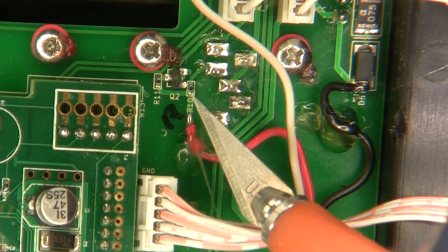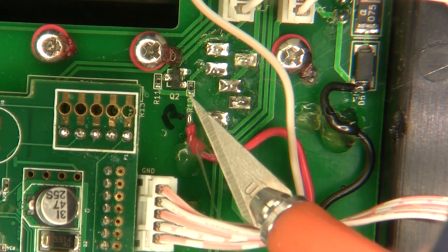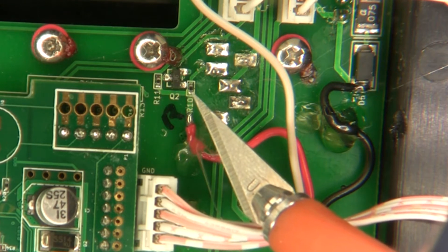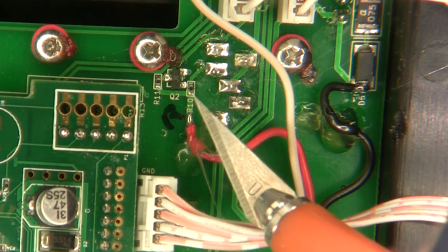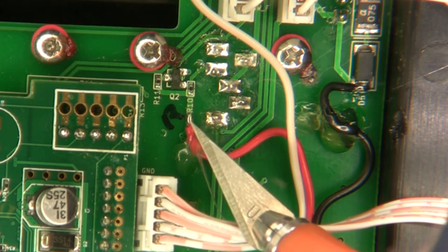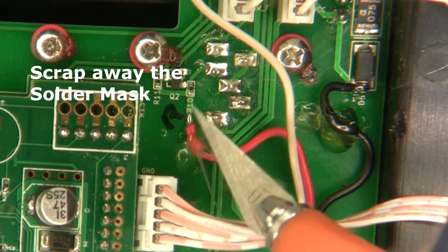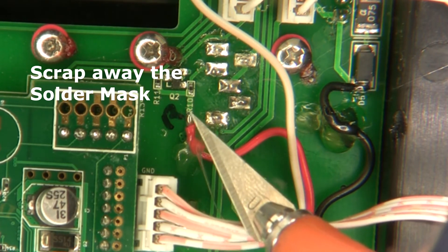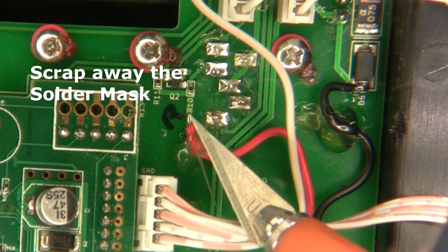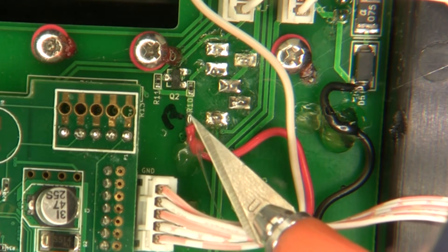I have the finest tip you can get from my Hakko soldering iron, and I still wasn't really able to do it. I saw how small it was and figured I needed a better way. So what I did was I scraped away a little bit of the insulation on the board over the trace that comes from R10 over here to this pad right here. I just scraped off a little bit of that covering — the green material — and then hit it with my flux pen and got it nice and clean.